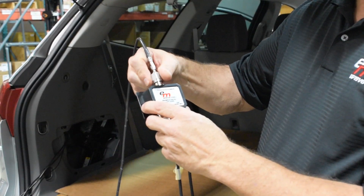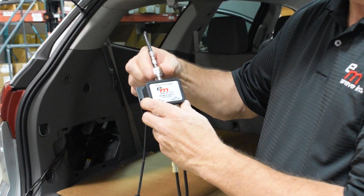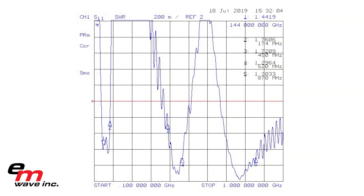To show you the specific VSWR results for this application. This VSWR plot depicts the multiband input impedance, connecting both antennas with excellent VSWR match across all 3 bands: 144-174 MHz, 450-520 MHz, and 746-870 MHz.